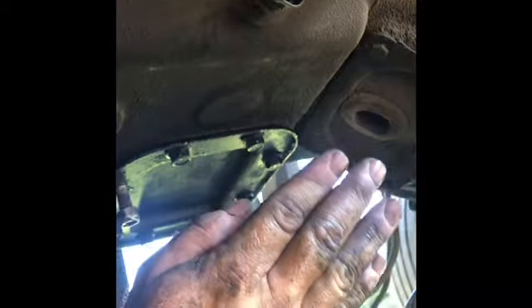Got the PTO off. Got the plate back on it to keep trash out, and right there is where our transmission jack is going to lift — we'll have two-by-fours on either side of this stud to balance it, because I'm not taking that stud out. Right here is your transmission temp sensor — unplug it.